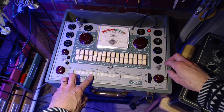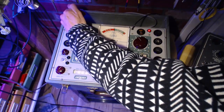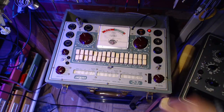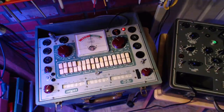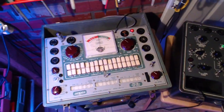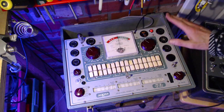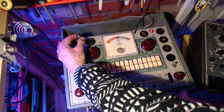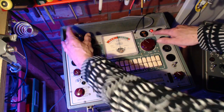Well, I see the tube heating up. Let's give it the test. W. Boom. What's going on here? Something's up. Something's not quite right. So we watch the pilot light. I will wiggle the tube, and if the pilot light fluctuates, I know the tube heaters are making and losing contact. This tube is warm. So I see nothing happening here.